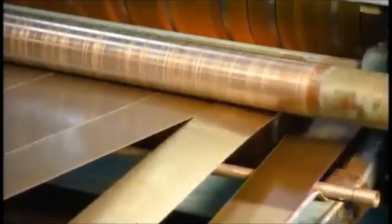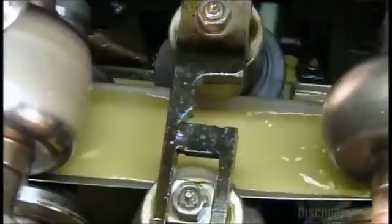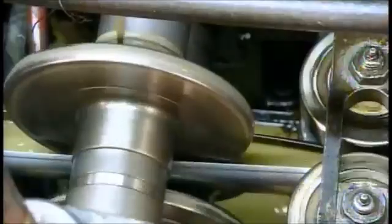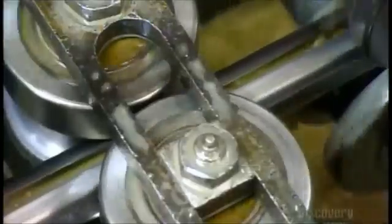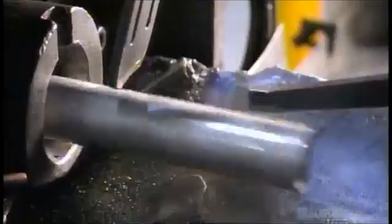The factory makes both these tubes from a steel sheet sliced into strips. Inside this tube mill, coolant prevents the passing strip from overheating as one forming roller after another gradually rounds it into a tube. Then a copper welding wheel fuses the tube closed. As the 5.5-meter-long tube comes off the mill, a cutting tool chops it into shock absorber lengths.